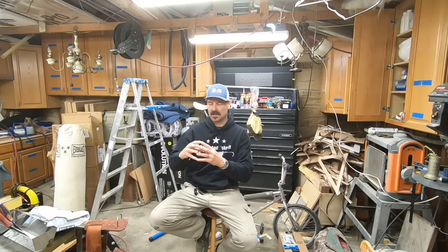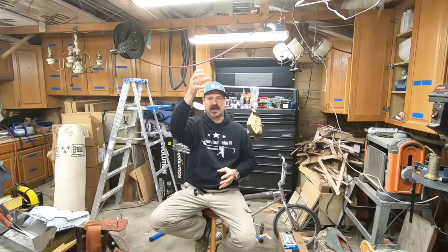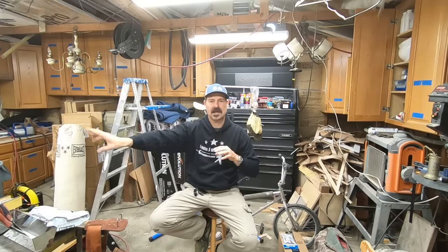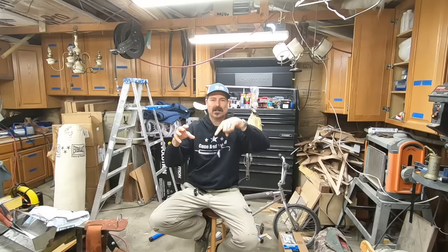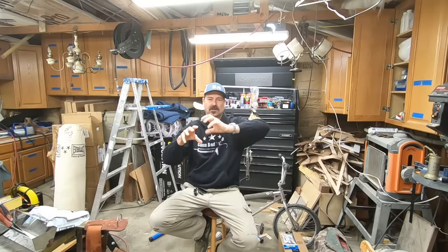How did I know that? Because there's a clean out in the basement. You have your main stack come down and then there's a clean out where you can go run a snake down under the basement slab and clean everything out. Well, that clean out had been so wallowed out. So there's a cap that goes on there. The cap was off because it couldn't even get the cap on it.